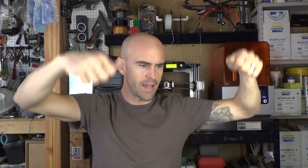The printer handles all those things automatically. The print bed also has compensation for heating, so it heats more around the edges where my old one would get cooler. If I'm printing ABS in particular, printing too close to the edges means it doesn't adhere as well and it might warp. And it has this cool sheet that is magnetized down — you slap it on and the print bed is just that sheet. You can remove it, flex it a little bit, and the print comes right off. You don't have to scrape. Really, really great — all giant pluses.